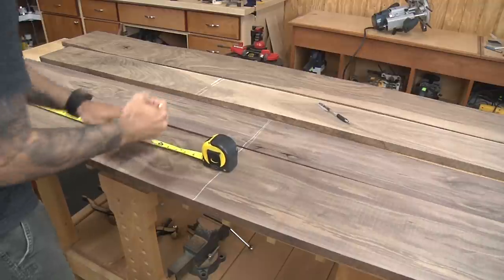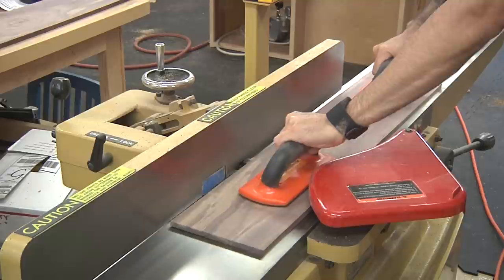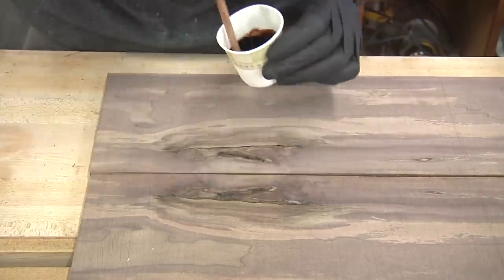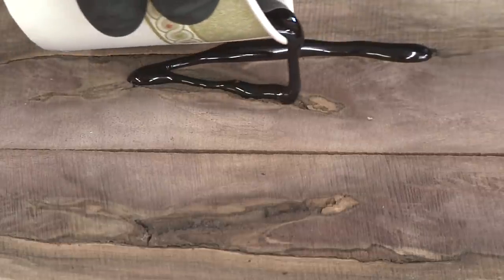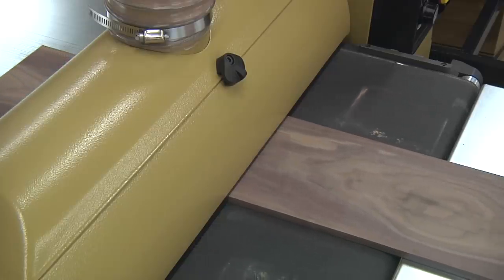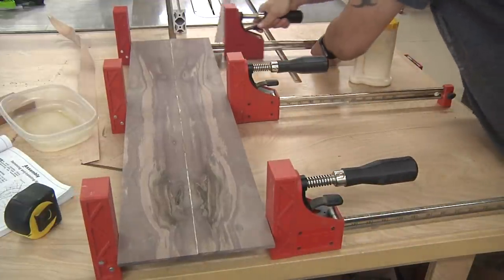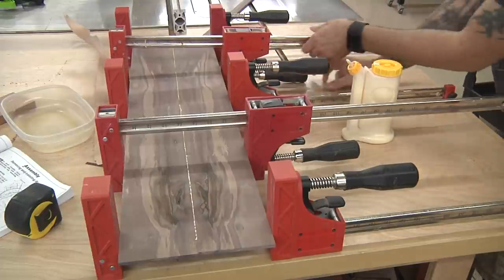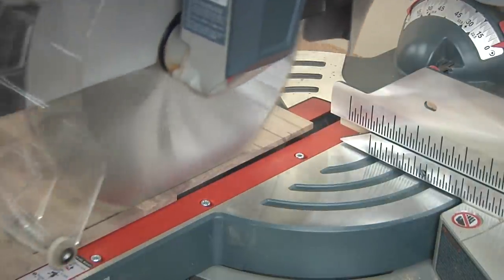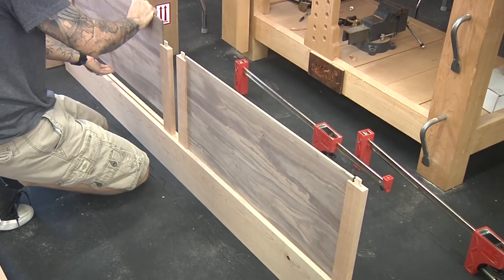The final things we need to make are the panels. I'll be using some rustic-looking walnut for a striking visual impact. The boards are resawed down the middle, allowing me to create a nice bookmatched panel. One of the larger panels has a pretty significant knot which I'll fill with some epoxy containing a dark brown dye. Blue tape on the back end will prevent that epoxy from seeping out. Once the epoxy is dry, I sand most of it away and then head to the drum sander to bring the boards down to their final thickness. Check out that cool bookmatched grain. When gluing up panels with parallel clamps, I recommend alternating clamps up and down to help promote even pressure and ultimately panel flatness. The final length and width of our panels is measured directly from the dry assembled headboard and footboard. While my big panels are a bit too wide for the chop saw, I can still get the job done by flipping the partially cut piece over and carefully lining up the blade for a second cut — it works like a charm. A quick test fit and we're ready to move on.